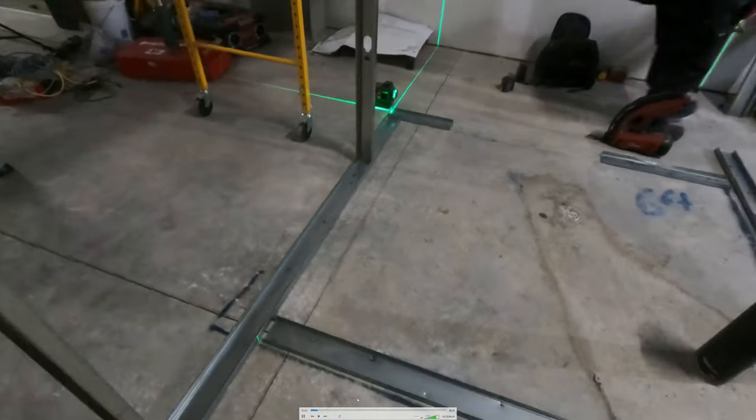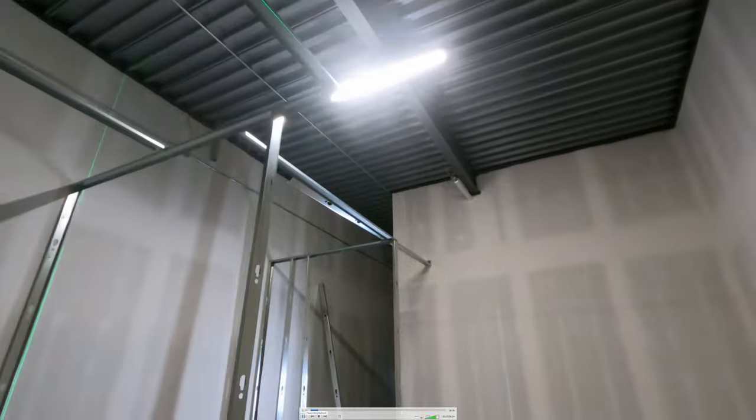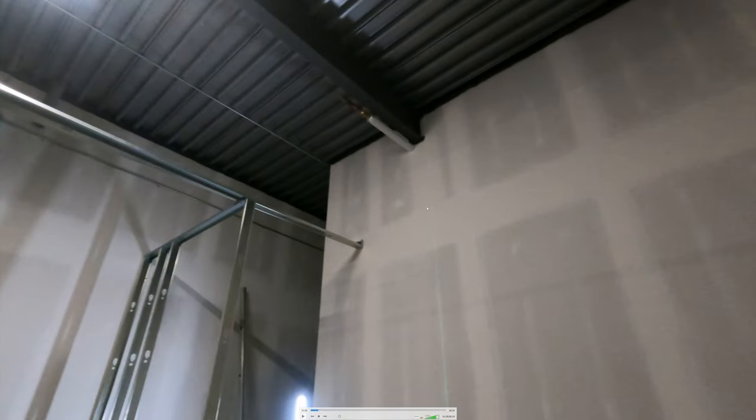You can see where we're leaving spaces for the drywall, and these are our door openings. When I'm doing my layout, I square my door openings so that even if my track isn't square, I can still see my square line when putting studs in. I put my studs to the square line always, then laser them up with the line laser. When drywalling, you still laser in the door frame on the hinge side always, and you leave the spreader bar in till the end.